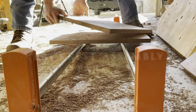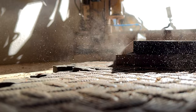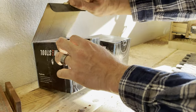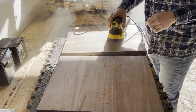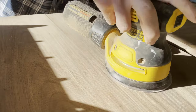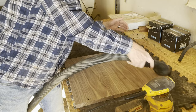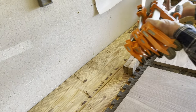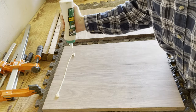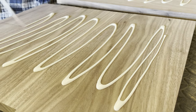As we transition to the second part of the backrest assembly, my priorities include: one, ensuring flush surface-to-surface contact to create a strong bond; and two, perpendicular grains between surfaces to create additional strength. Although the user might change over the years, I want this thing to last a hundred years. So I am most concerned about the quality, durability, and longevity of this piece — and this goes for any and all of my future work. I simply want to continue to raise the bar as high as it can go. We lather up each side with a nice thick layer of glue, without concern for excess, as the perimeter will also be CNC-ed.